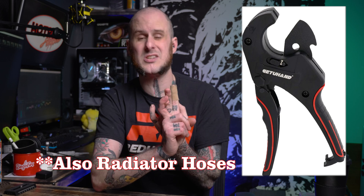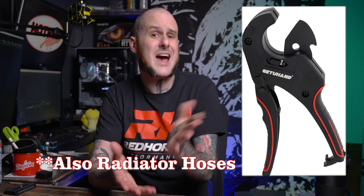Now let's talk about the tools you're going to need to do this job. Honestly, it's a pretty short list. You're going to need wrenches, obviously to tighten your fittings. For the more specialty tools, there are two tools I use on a regular basis for cutting AC hoses. One that I'm liking at the moment is this simple, cheap hose cutter — it actually came with the next tool I'm going to show you, but it works beautifully. The other tool I use to cut hoses — and I actually use this far more regularly than I ever thought I would — is a ratcheting PVC cutter. The ratcheting mechanism allows for high torque application and cuts a nice clean straight line through the rubber hoses we deal with. I use it on AC hoses, heater hoses, and filler neck hoses, though it doesn't love filler neck hoses with steel braiding inside.